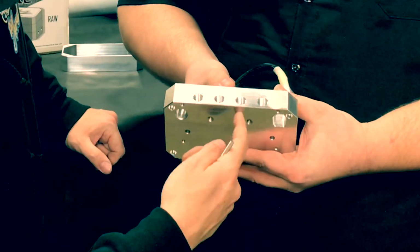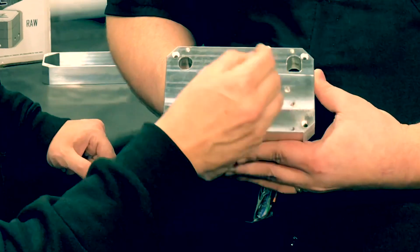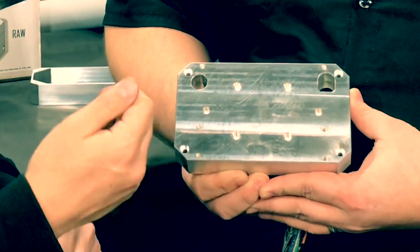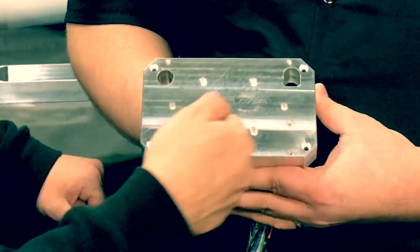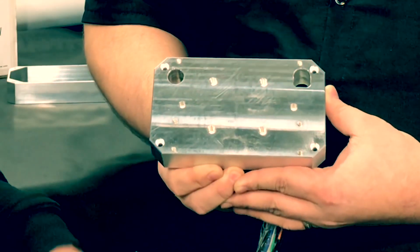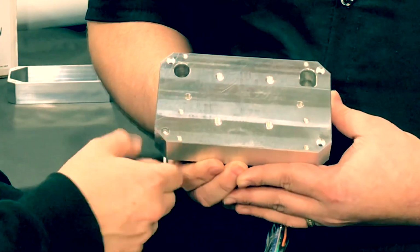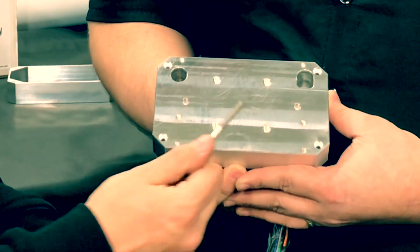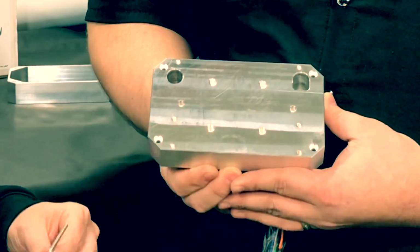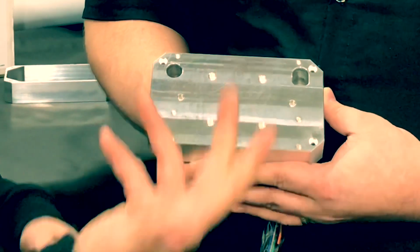Also, if you tilt it back, this hole right here is a funny shaped hole because it's exactly the right shape to accept the harness to an AccuWire pressure switch. Goes right in. The lid fasteners are undermounted, so you don't have to look at them because they're super ugly. And it's got an additional 4 mounting holes, which were added during machining for ease of machining, but also there's now 4 additional holes to mount it.